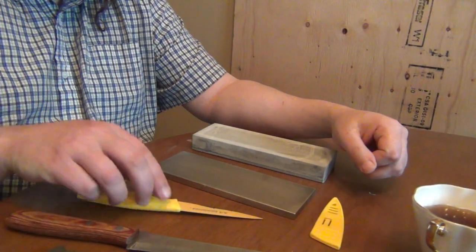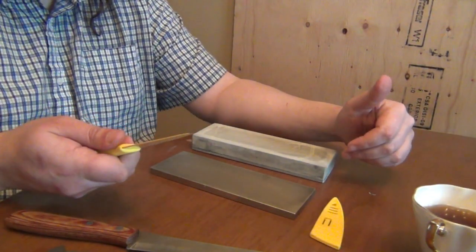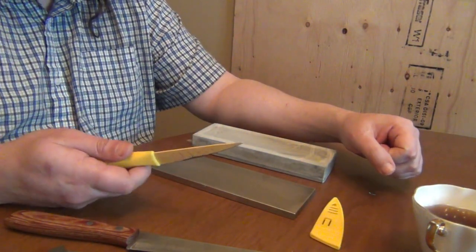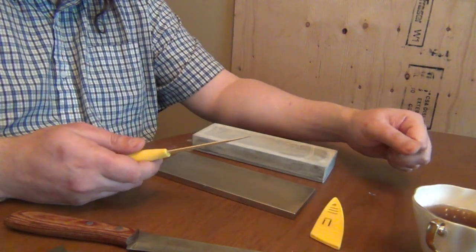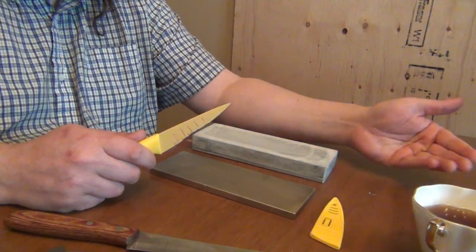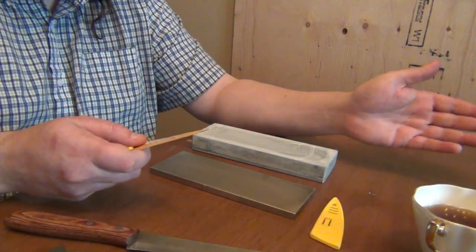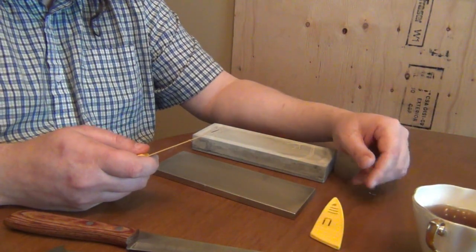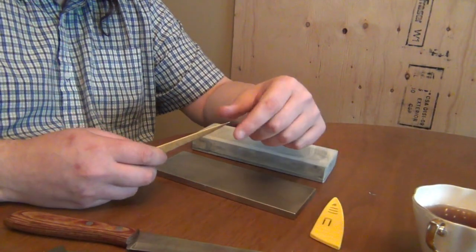Interestingly enough, though, while I was using it for cutting up some of the cardboard, I was also doing some woodwork with it and some rope with it. I wanted to remove some of that fatigued metal along the edge. I wanted to sharpen it a bunch of times anyway, because one of the points I wanted to make to the owner when I returned it was, just look at the difference in performance between the paring knife, where I ground off some of the damaged metal, and the other knives where I didn't. Because sometimes the first time you sharpen a knife for somebody, if you haven't done it before, and you grind off, like say 1 millimeter or even 0.5 millimeter of steel to get rid of all that fatigued metal, it can sort of freak them out a little bit.